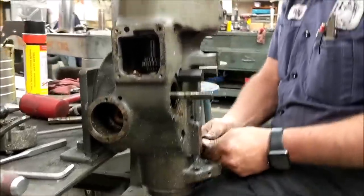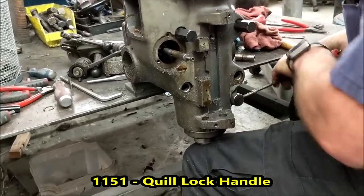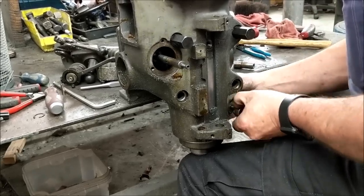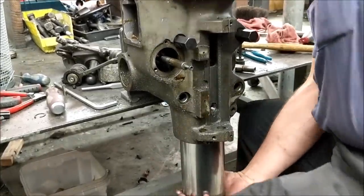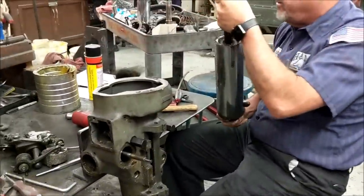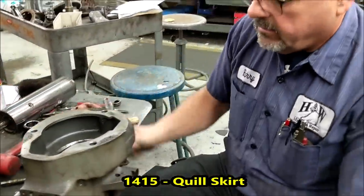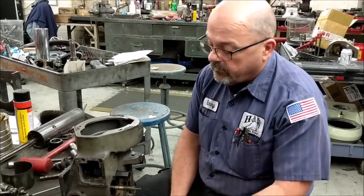Now we're going to remove the quill. Just take your lock loose — this one has a modified handle, so we're going to take that off because it'll be replaced anyway. Just unthread it a little bit and knock your pin out. You can get your locks out. In a perfect world, the quill will just fall. Take your spindle assembly out — be careful with the spindle assembly; that's something you don't want to bounce around willy-nilly. The only thing left up here is your quill skirt. If you need to get into that part, that will be another video at a future time. Thanks for watching, and don't forget to subscribe to our YouTube channel.